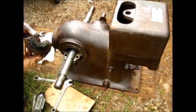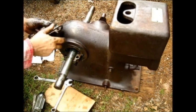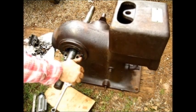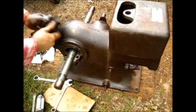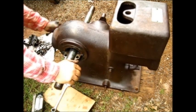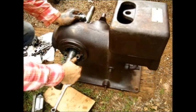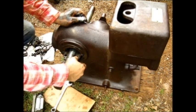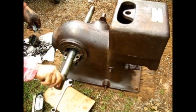Let's look at this right here before we move on — that bearing cap. Remember them shims in there. Never forget them shims, save them shims. That one didn't have very many in there. The bearing and the cap — you can't get them mixed up. Just take my word for it, you can't get them mixed up. Same way on the other side: cap, shim, bearing. It looks good. The way that works is that shim comes over past the lip of that bearing and keeps that bearing from turning — that's the reason it don't rotate in there. Let's move to the other side and get them bolts out of there.